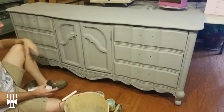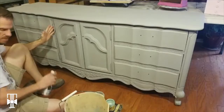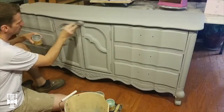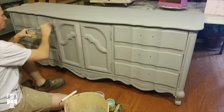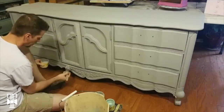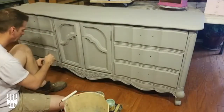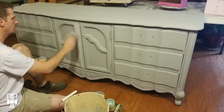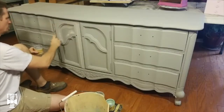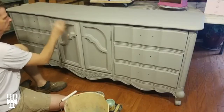First thing you want to do when blending is just wet the surface down — get a nice little mist because you want to keep the paint wet; you don't want to do any dry brushing at this point. Work in sections, you need a plan. Maybe do a demonstration on an old cabinet door if you're not comfortable. The beauty of chalk paint is that if you mess up, let it dry, put a fan on it, and paint over it. I even turned off my fan — I don't want this stuff drying faster than it should.